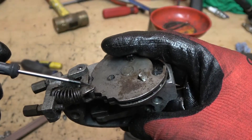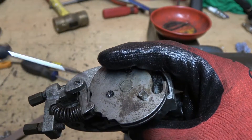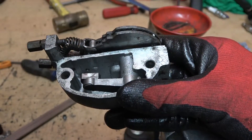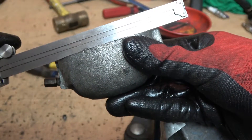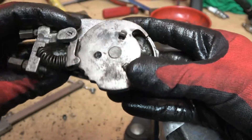In third gear position - which is the next to last one on an EFL gearbox - this needs to be level with the gasket face, which it just about is. So it's already in the right position.